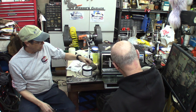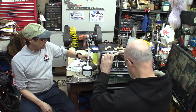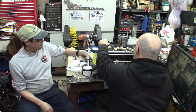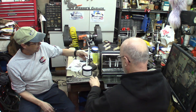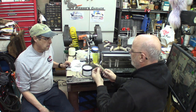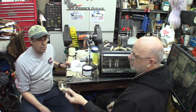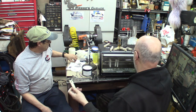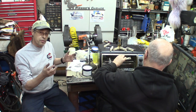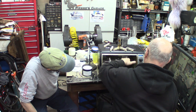All the parts were totally degreased and then burnished with a bit of the stuff to help it adhere. If it's too slick, it seems to run off. This is going to make some kind of a ceramic-y product, more like some kind of a clay. It just prevents the oxygen from interacting when you're heat treating it.